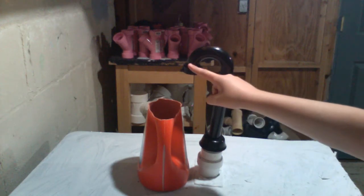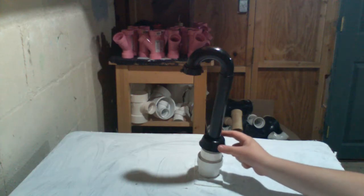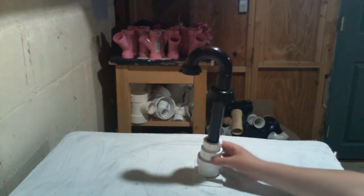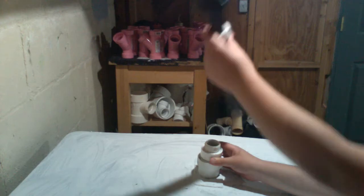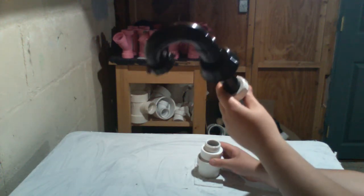Now we have this tube coming out of the floor. There'll be no water in this so you don't need the bucket anymore. To loosen this tube — there used to be an escutcheon here that covers up the hole in the floor. Pull this up; there's a slip drain connection under it, and this can just be unscrewed. That whole assembly comes out. Make sure you save this until you replace the s-trap because you might need it for measurements.